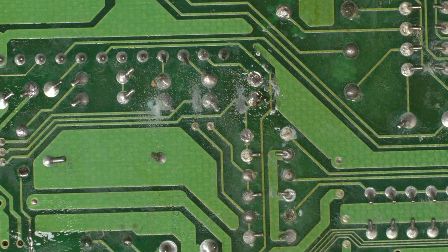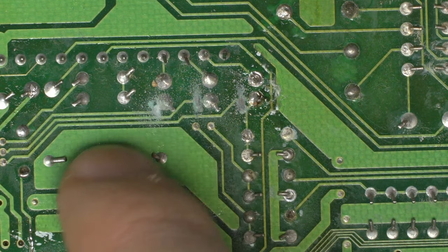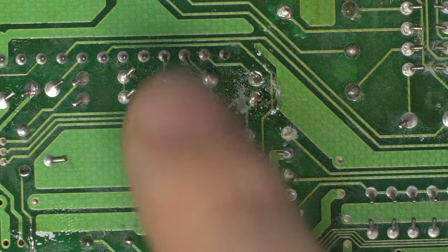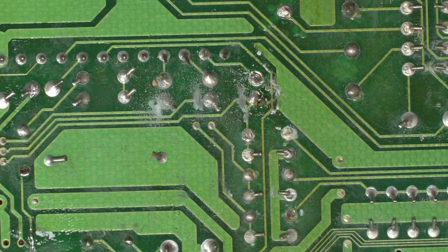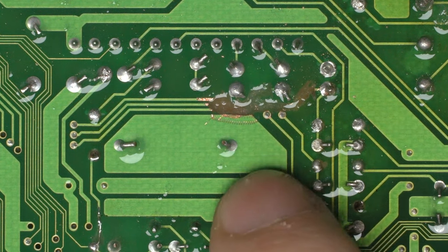And remember what I mentioned about the crosstalk. You don't want to do small cuts like this because that can still jump. This rail is going to have noise here as well. So I'm going to take back quite a lot, and we might even want to just obliterate these traces if you wanted to remove noise, but I'm just going to remove them a bit further back than that. So that's them traces well and truly obliterated out the way.